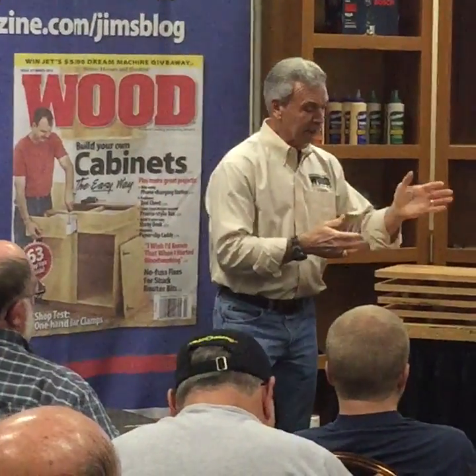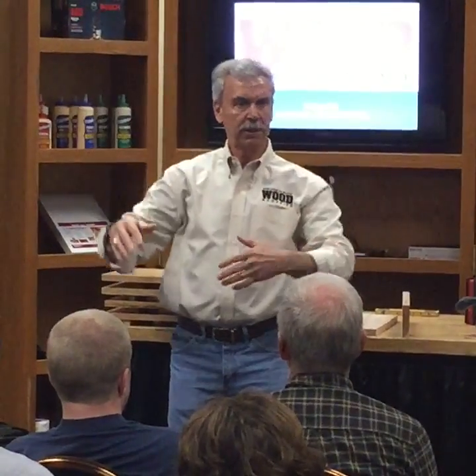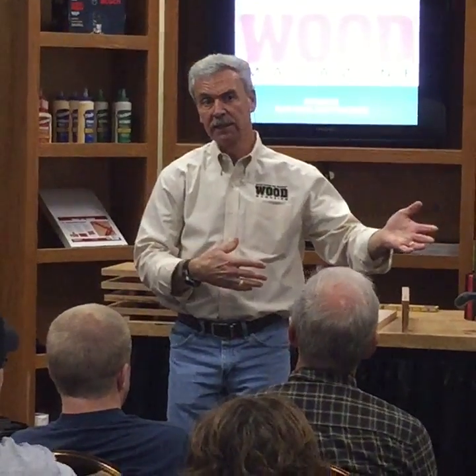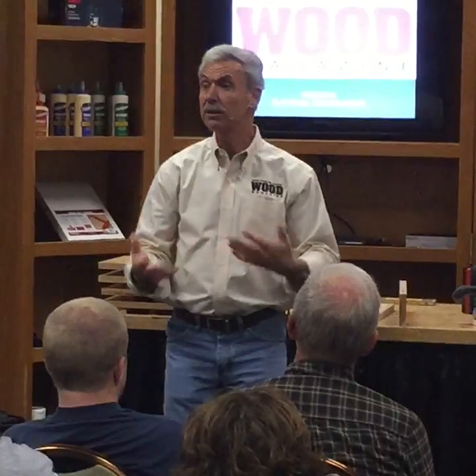So, the only way to get flat panels is to buy flat wood. And it sounds kind of silly to say that, but the fact is a lot of you are intimidated when you go into a lumber yard, when you know that the person that owns that yard has got his hands on his hips thinking, come on, pal, make a decision. You're never going to buy the top sheet of plywood in any stack ever, because that top sheet is always twisted. It's always got some kind of a warp to it. So you go through the first couple of pieces right off the bat, and you go to that one that's a lot flatter, and that's a good idea.